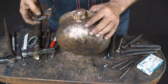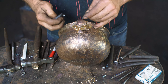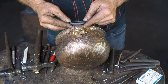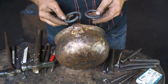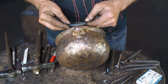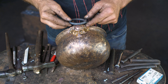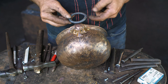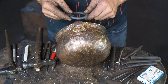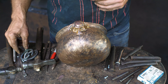Okay, so I'm ready to do rings here and just grabbing an arbitrary couple of rings around the shop. Looks like something about this size is going to be right to span through the holes there. That's 5/16ths, this would be 3/8ths. I think probably the 5/16ths would be a better scale for everything here, so that's what I'm going to do. But rather than just do a plain round ring, I'd like to do a rope twist on this. So let's go to the forge and begin the rope twist.